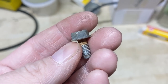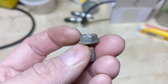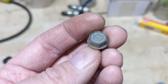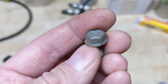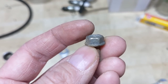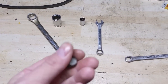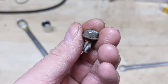For me, I've noticed that the three-eighths headed screws on a lot of snowblowers now have a really rounded head to them — almost like the manufacturers are trying to make them tamper proof so that people cannot remove them. Now this is not one of them; this is the older style of hex head that you would see on a snowblower's access panel, and this one has the bevel on the top of the bolt head. But a lot of the newer ones really pronounce that bevel and I have had issues where even my socket has slipped, so I'm thinking about taking a three-eighths socket and grinding the bevel off to increase that contact area and decrease the chances of rounding one of those bolt heads off.